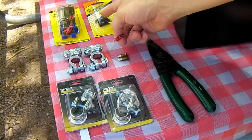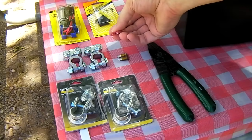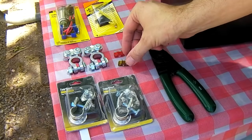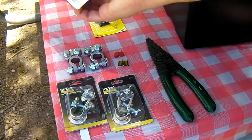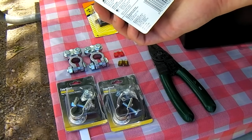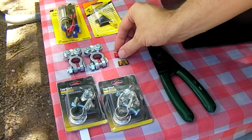You're also going to need a couple of fuses to go in the inline fuse holder — like a 10 amp, or you could go as low as 5 amp depending on how much power you're going to be pulling through this thing. I would suggest a 10. The highest you can probably go is 15. The package usually doesn't say the rating, but it's typically 10 or 15 amp.